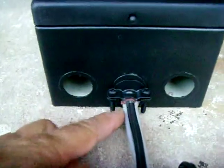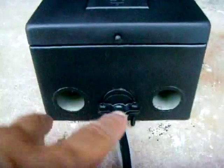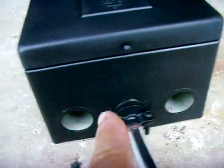Three-quarter inch Romex clamp. I took out two knockouts. The reason why I did that — the transformer is in the middle right here. When this fan comes on, it blows air out, and it sucks the air in through these two holes. It cools the transformer as it goes through, and it passes the diodes. So it worked out perfectly.